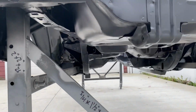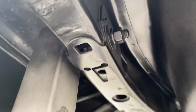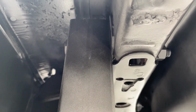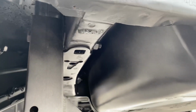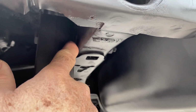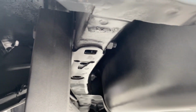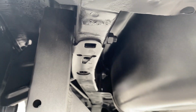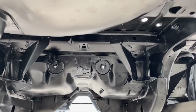And in the rear, it just bolts on in the very back. You can see where the factory 5-mile-per-hour bumper shock absorber things bolted in. One word of advice, I didn't do it on this car, and it's a tight fit in the back: if you're going to do something like this, put a flat washer in there. It's a spacer. I totally forgot about doing that flat washer deal. So it's a tight fit, but it goes on. It just takes a little wiggling around.